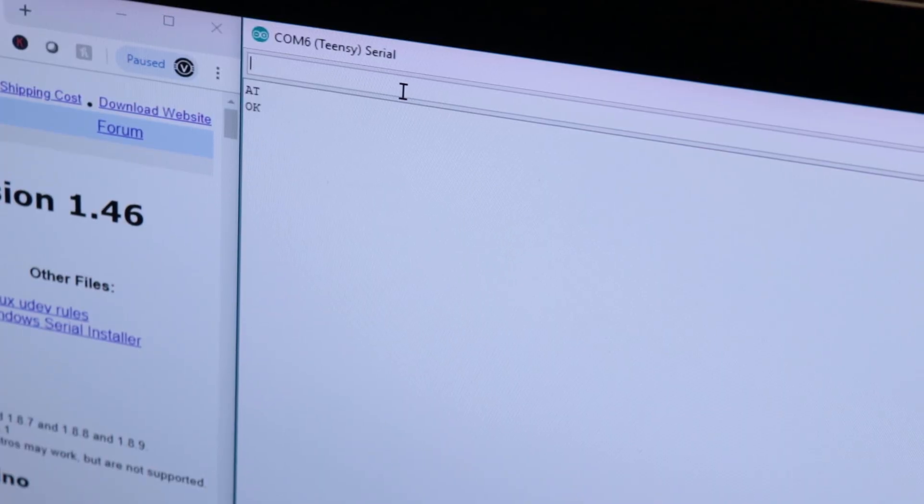Many GSM modules operate based on a simple serial AT command interface. I won't go into the nitty-gritty of what that means, but if you have an interest in telecom history and networking, I highly recommend checking it out. There are hundreds of different AT commands depending on the manufacturer, but suffice it to say they're simple and human-readable commands that you send via serial, and you get a straightforward response back. That's how I'm going to be using the Pi to connect to the network.